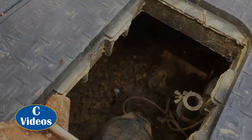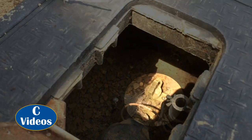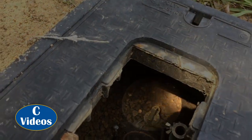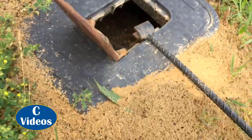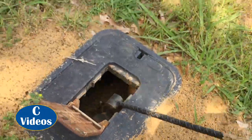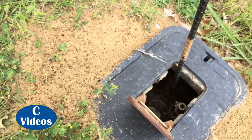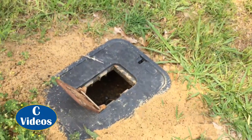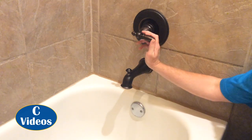So on this one, there's a valve that has to be turned right down there. You can do it with a wrench, but what works better is if you have a specific tool for doing the water — and that tool looks like this, which will soon be covered in ants. Just a quarter turn and the water should be off. All right, now we've got the water off. I want to make sure it's off and let any pressure that's in the line out.